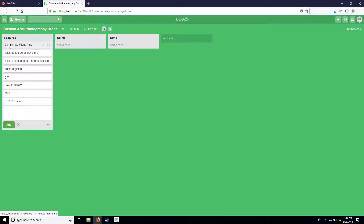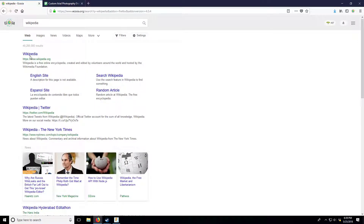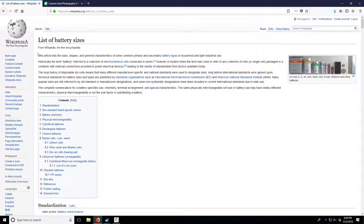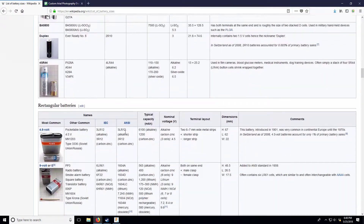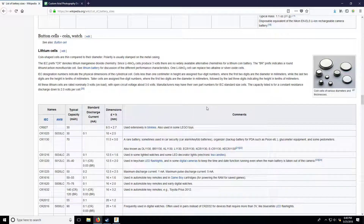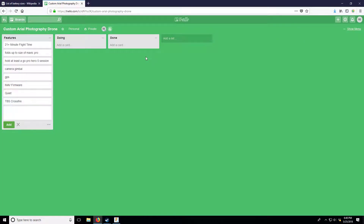So that's basically it for the features. I did a rule-of-thumb series last month where we talked about battery sizes and lithium ion versus lipo, and now this is where it comes into play. We're going to find out why lithium ion is the best fit for this particular setup, what that would actually look like, and why it gives us limitations on how much power we can use to run these motors and how we're going to solve that.